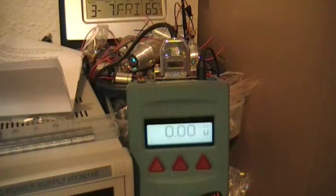Hi, this is Rick. I'm fixing to test the six-watt laser and see what kind of power I get and the run time. The driver is a simple driver I made myself. They work good but they overheat quick. It has a thermal shutdown, so I'm hoping to get at least 30 seconds of run time before it starts shutting down. But anyway, I'm fixing to fire it up and see what we get.